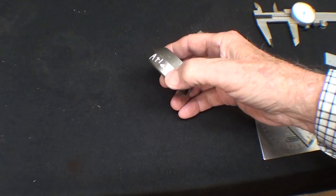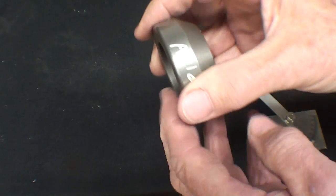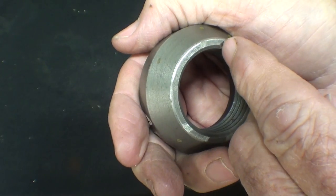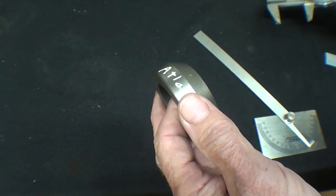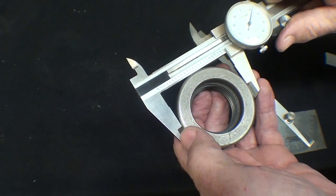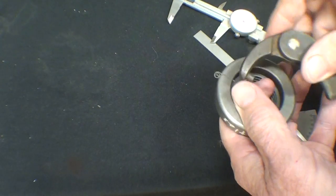When I make a project such as this, I realize that hardly anyone will actually make one of these, but you might find it interesting to see all of the different machining steps. Let's look at a few of the dimensions on this existing one — and I had a laugh, because look at all the damage to the thread protector. That appears to be grinding, like they hit it with a grinding wheel on a tool post grinder. The diameter is approximately 2 and 5/16 inches, and you need some diameter in order to drill a hole so you can use your spanner — the pin on the spanner.